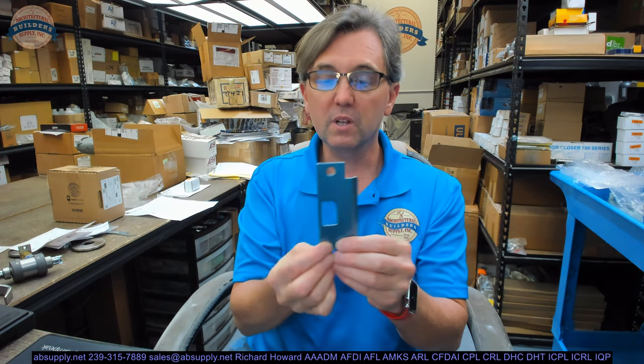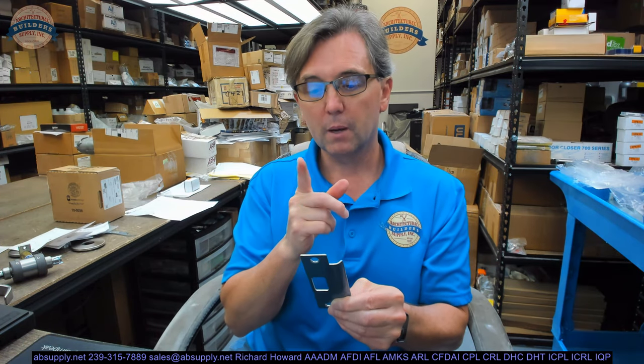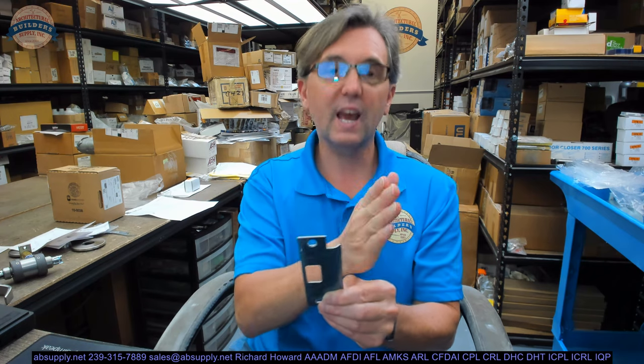On the secured side or the pull side of the opening, you're going to need a longer lip length, a longer spindle, longer fasteners — most likely longer mounting posts. You're going to need a longer cylinder as well. When I told the factory I needed a 28 — that's the Sargent part number for this strike — it's assumed to be inch and a quarter unless you specify, which is what that inch and a quarter on the box means. But I called out two and a quarter, so there's an error somewhere. I want a 28, and then the dimension when it's other than standard.